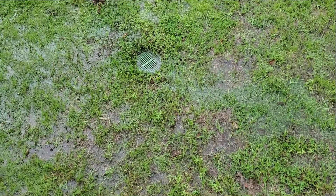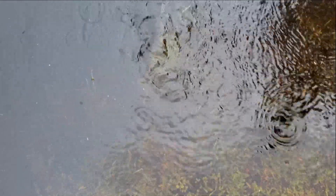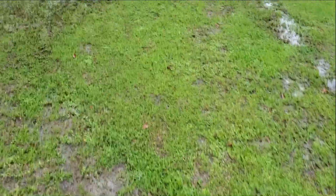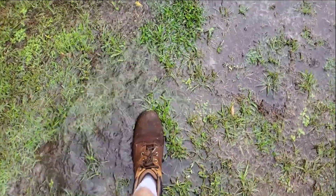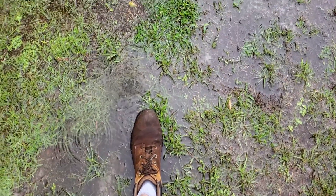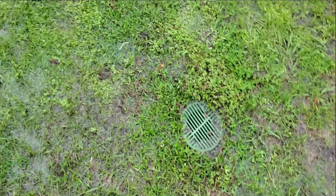This section is really drying out quick. Look at that discharge — it's still pushing water even though it's underwater here at the swale. There's so much water in the ground when we get rainfall here in Florida — this was probably about four to five inches in less than 30 minutes. Here's the gravel perforated pipe wrapped in fabric — most of that water is going into the catch basin, it's not going through. The fabric is packed tight with sand. But over here on the easy flow side, there's much less standing water.